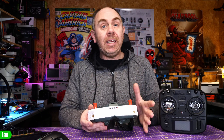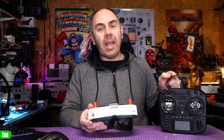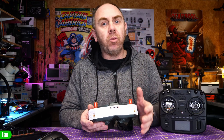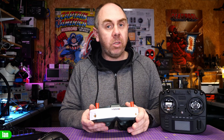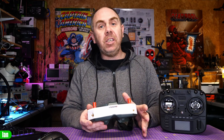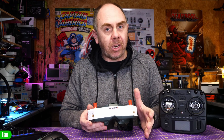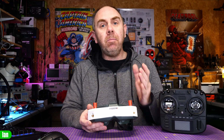So that is pretty much the setup process. It's as simple as updating the firmware on the goggles, making sure your module is updated, linking the two together, then configuring your flight controller if your VTX is capable of MSP VTX like all the HD Zero ones are, making sure that's configured, and making sure you've got Betaflight 4.4 — and then it should all simply work. It really does offer some nice functionality: you can change the channel, band, and power on your radio to control your goggles and VTX, automatically tell them to go to the right channel on power-up, and even start and stop recording via a radio switch. It's going to be really interesting to see how this develops in the future with the dev team at ExpressLRS and the HD Zero open source community.